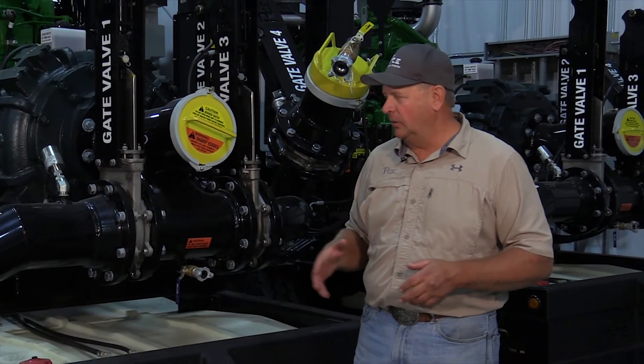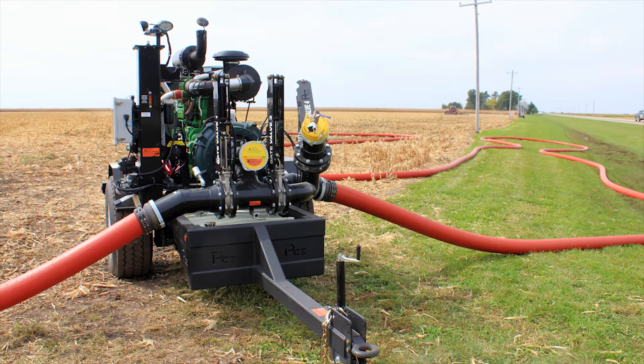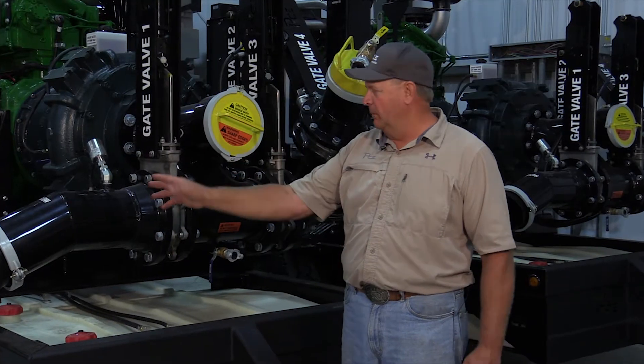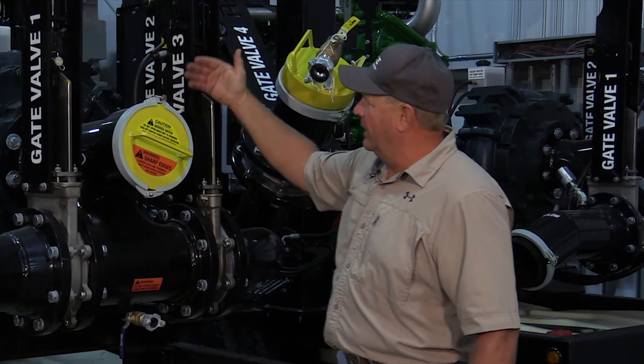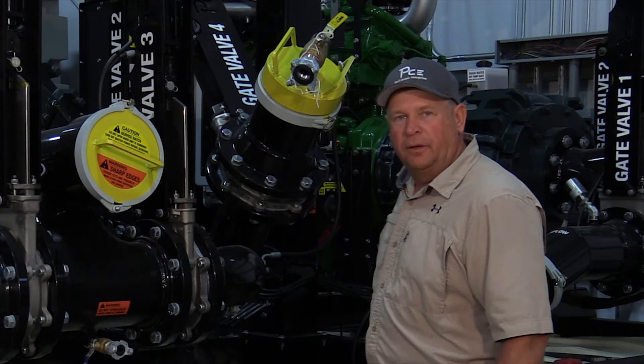This is what's really helped us save a lot of time in the field. Instead of trying to rehook the two hoses after they've been under pressure — they get squirrely under pressure — we simply hook the inlet hose to the inlet side, hook the outlet hose to the outlet side. When we get ready to clean out from the site, we can blow the pig through this apparatus by shutting the gate that keeps the liquid inside the pump, so that the pig will pass through here and bypass and continue out to the field.